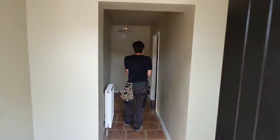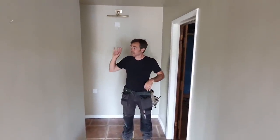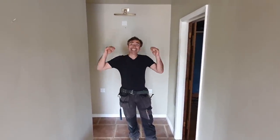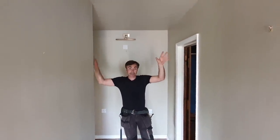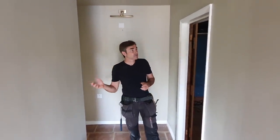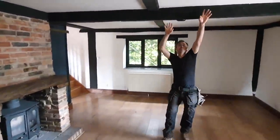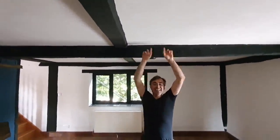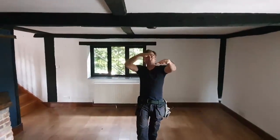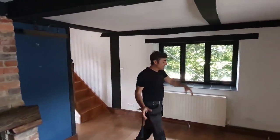In parts of the building we're going to try to leave a couple of rooms totally intact. For example, there's a room to my right which should remain intact, there's also an ensuite bathroom off that which should remain intact, and potentially the floor joists and ceilings can remain in these areas because they were done quite recently. But as we enter into the old part of the building, you can clearly see the ceiling is quite low — even for me, I can touch it. We want to take this one up to the level of the other side and make sure the floors are all level through, so all this is coming off.